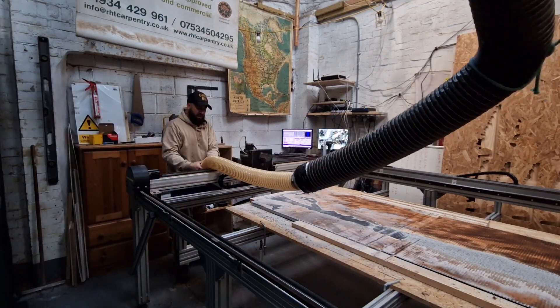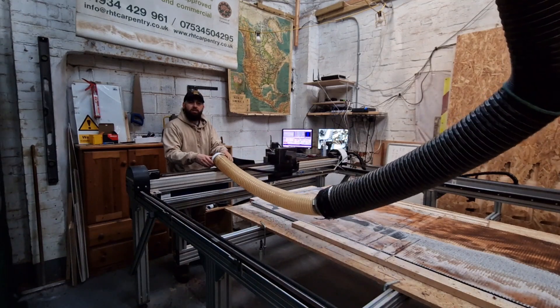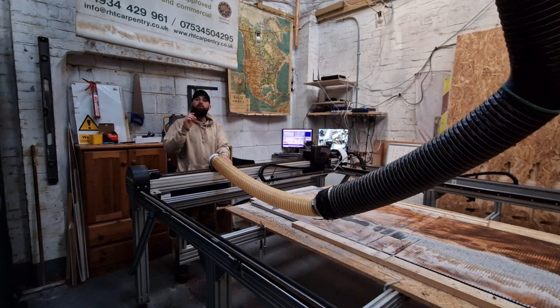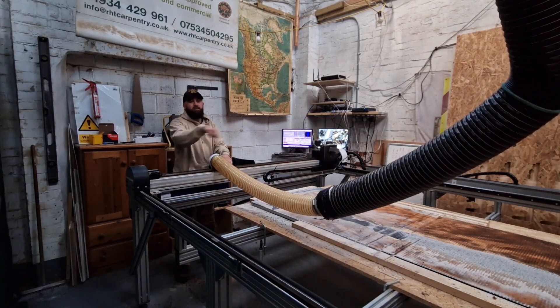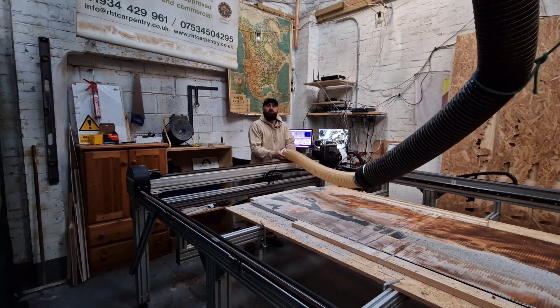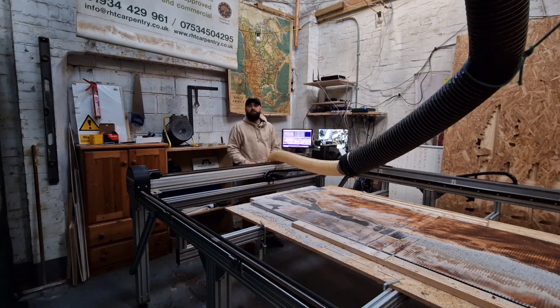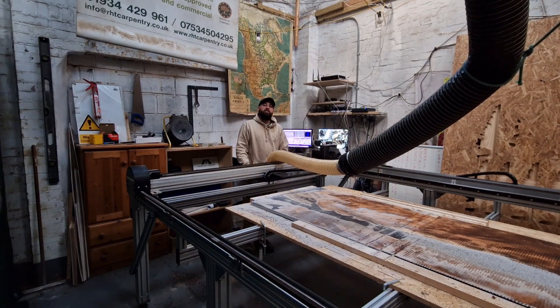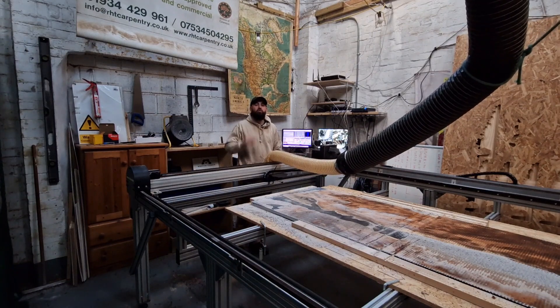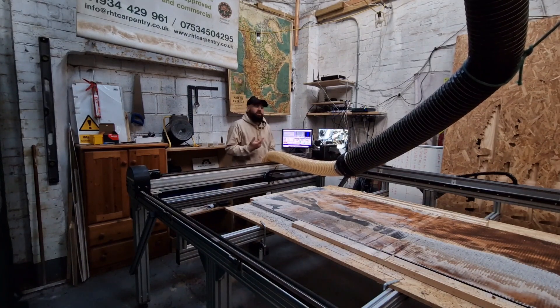It's always a good time now to check the router bit. I'm using carbide — a 12mm shaft with a 12mm four-flute cutter — to face my table tops. Other router bits like a two-flute cutter on a 6mm or 8mm collet haven't got the performance or cost-effectiveness to cut resin consistently. I use carbide because it's what everybody uses in the industrial CNC world. It clears out material better and cuts a lot cleaner, so you're not sanding as much at the final stage.